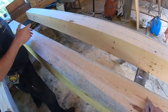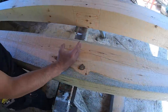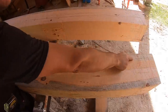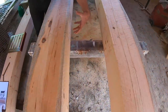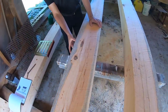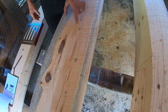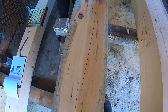What's this? This is our girding beam. This is our 8x10x18 that's going to carry the floor system. This is the height of the knee wall. 2 feet. So that was going to be the 8x10 coming in here with a 2-inch tenon. It's a through tenon right to the back, sitting on a 1/2 inch housing. And it has pegs. Those are the peg marks.